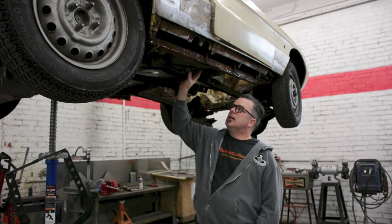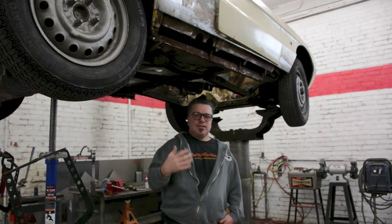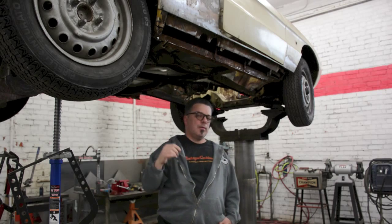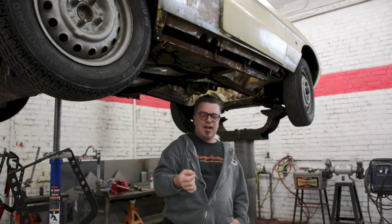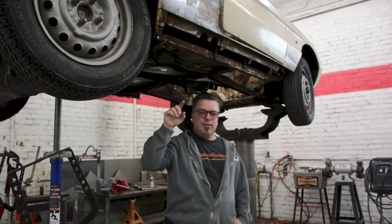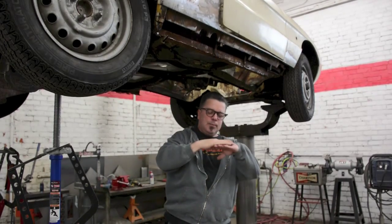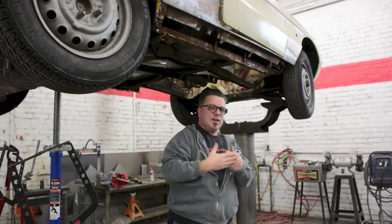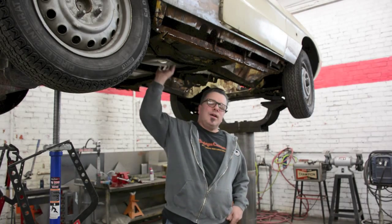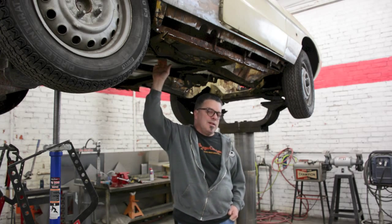But the point is a resistance weld is an ideal way for a mass production car, but it has its errors. When you are tearing one of your cars apart, you'll find that the inside of the car is probably very well seam sealed from the factory. That's that gray putty-like stuff, almost like a window glazing, on the inside. But effectively nothing was done underneath. So where all those welds are lapped over one another, that's an exposed environment. Well, you think about it, where you need the most protection is in the environment, not so much in the cab. So that's why these things also inherited a lot of rust, because the exteriors weren't nearly as protected as the interiors.